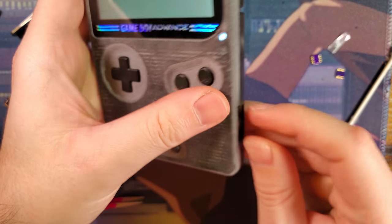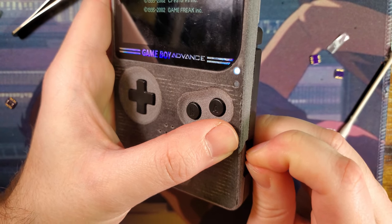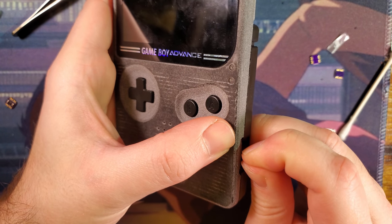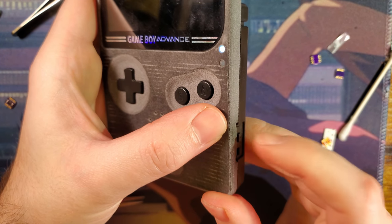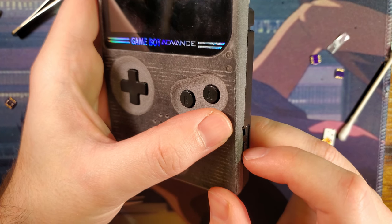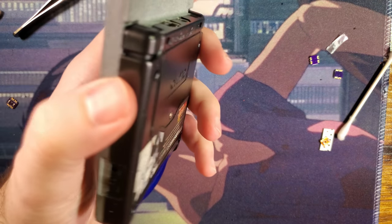So when the resistance changes, as I jiggle it a little, it's still passing enough current to tell the internal MOSFET to stay on. Now, eventually the switch will actually switch off, which will tell the MOSFET to switch off in turn. And the MOSFET has an internal drain resistor, so it doesn't matter that we just bypass the one in the Game Boy itself.